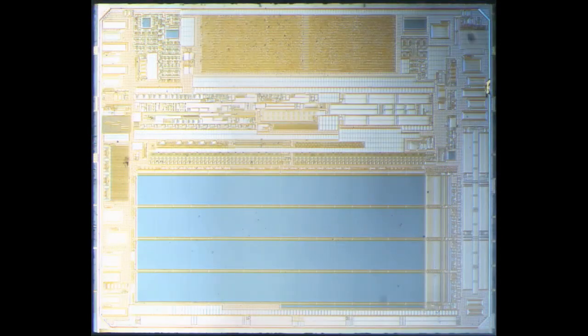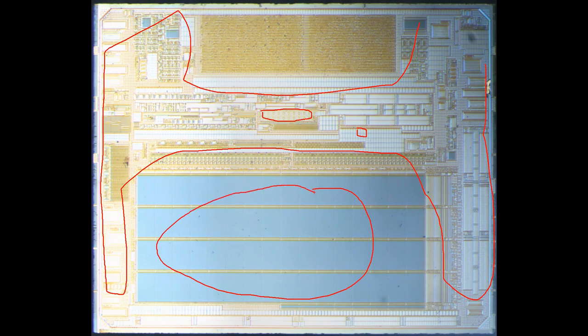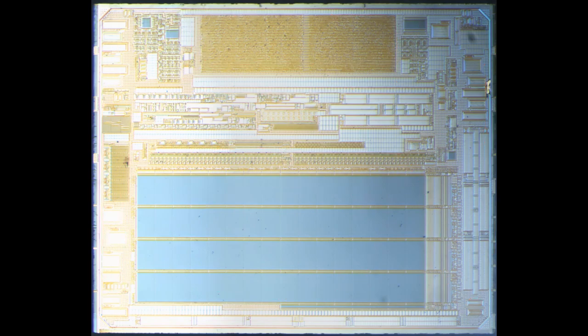If we pop over to the next picture it's actually much clearer. These larger rectangles are capacitors and capacitor arrays. Here and here, you're looking at power transistors. All of the circuitry in this H-shaped area is used to actually program the array, which sits in this gray area. The reason it's so indistinct is that the cells are so small — they're just barely visible by visible light. And that leaves the top section, which is basically laid out as a series of logic gates in an array providing the interface. Classic storage componentry.